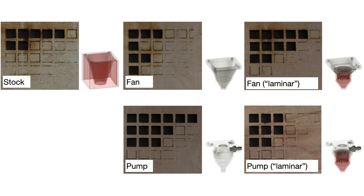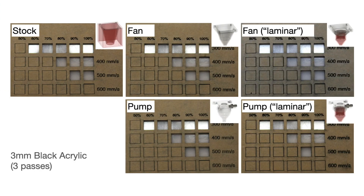Finally, to adjust for the variation in the material, I did go ahead and order some black acrylic and repeated exactly the same test. This time the cut-through results were far more consistent except for this one square here. When it comes to acrylic, the higher pressure nozzle has a pretty limited benefit.